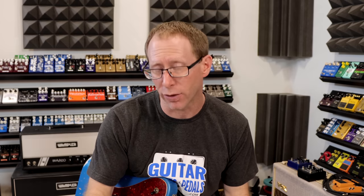Now this circuit is kind of the same — still op-amp based — but this is utilizing inverting op-amp stages. The boost is sort of like the Vertex boost; that's the circuit type we're going for here. It's still fairly neutral. Whenever you turn up the gain control — again, gain not clipping, not distortion, but gain, in other words volume — it's actually bumping just a little bit of mids. It's a cool circuit, sounds good.